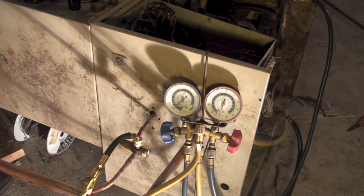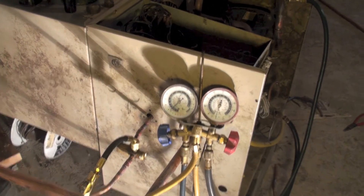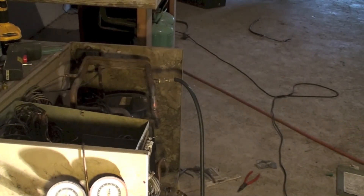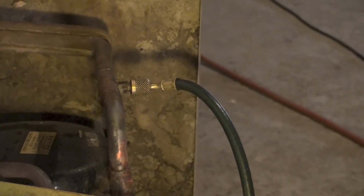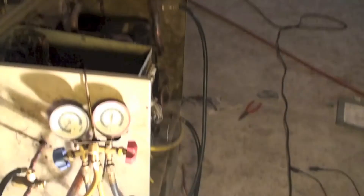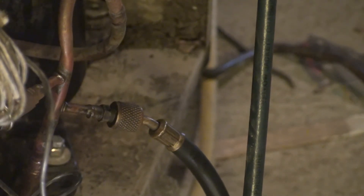What I've done is put another gauge set on, and I'll move the camera around so you can see it. I've connected up that gauge set - if this is a heat pump you can do this; with air conditioning you probably won't have it. I've tapped on at the common suction and also at the common high side with another gauge set.